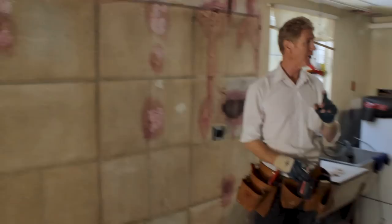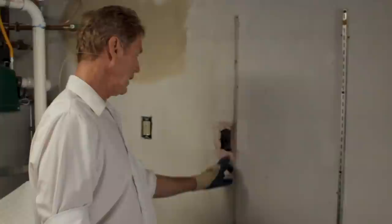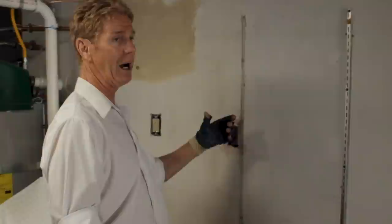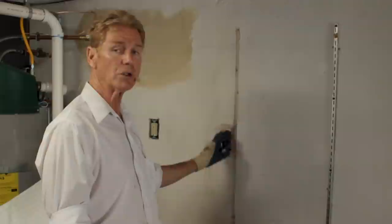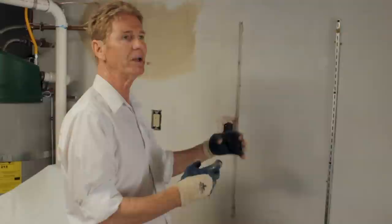I wanted to point something else out. If you close in your electrical panels — like these light switches they're not going to use — we put the bonding agent around it. There are no wires in here, and we just put a little bit of wire. When I plaster this, I'm going to fill this whole box up. It's just going to plaster right through this metal. If you do have wires, make sure the wires are capped or put a membrane over them, so no plaster gets in between the wires and shorts anything out.